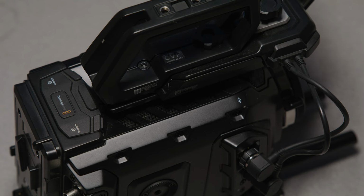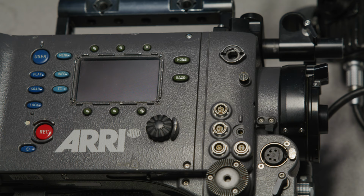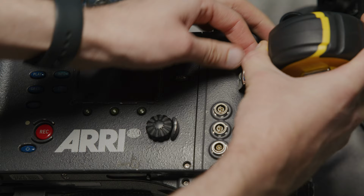Make sure you're using the sensor mark or phi mark on your camera. It looks like this. To measure from the chart to your camera, and make sure your camera is as square onto the chart as possible. Some cameras will have a tape hook at this position, so you can hook a tape measure onto it to make things easier.